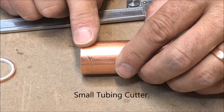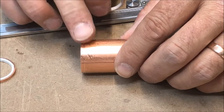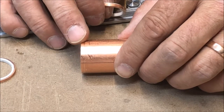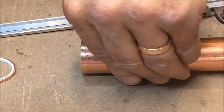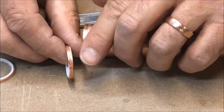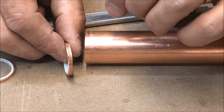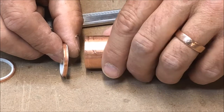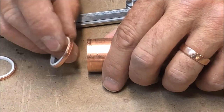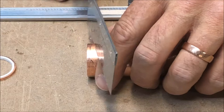I've used a couple of techniques to cut this pipe. One of them is a pipe cutter — it's okay, except you have to find a pipe cutter that's got a very narrow shelf on it because there's not much material on this side of the blade. Some of the small micro cutters seem to work pretty well. The disadvantage of those is it cuts a v-shaped groove, so there's an angled taper on the side. I found I had to account for that and increase the width of my cut a little bit so that when I file it down, I still have my one hundred thousandths tread width.